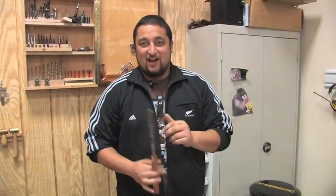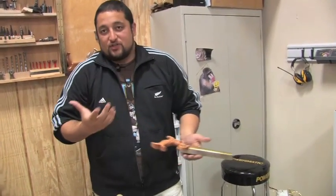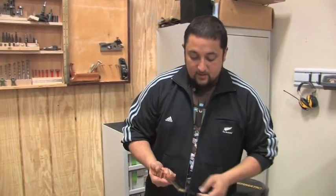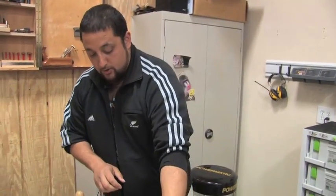This is my favorite saw. I like pistol grip saws personally — maybe my hands are a little bigger so I can't get them into the other saws. I always check the set on my saws too, so I usually mark a few lines on a board.